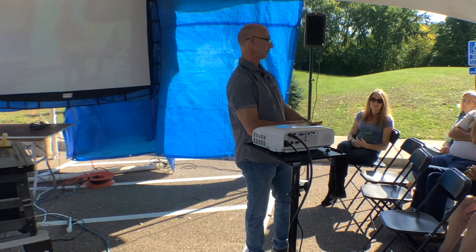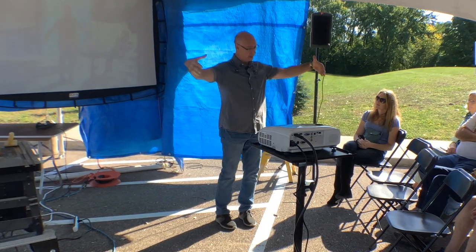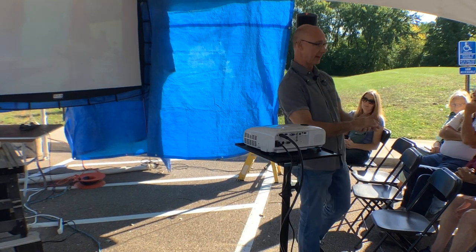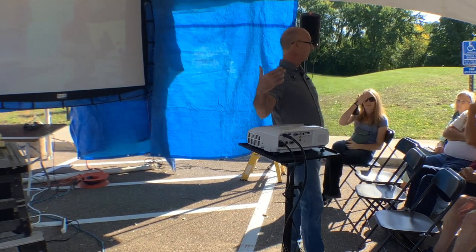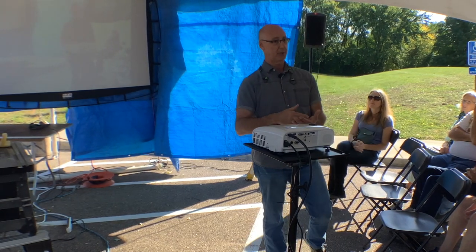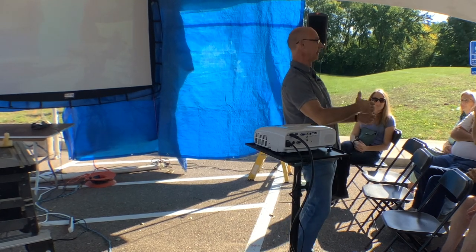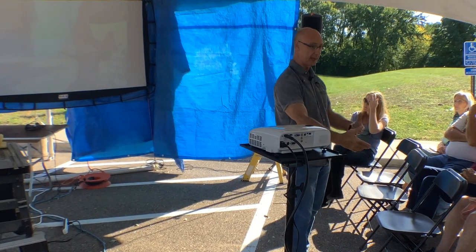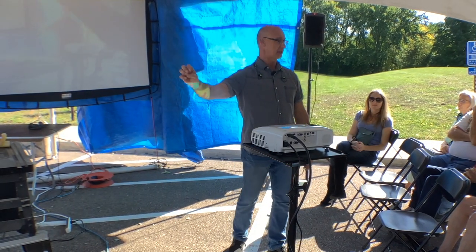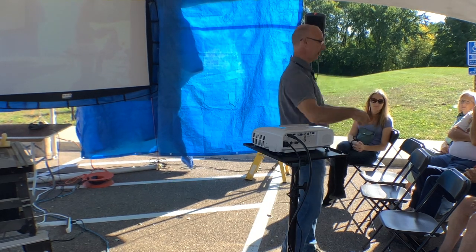Yes. Okay. Shapers versus router tables. Broad brush strokes. A shaper is a high power, low RPM tool. A router table is a low power, high RPM tool. So shapers typically have induction motors in them, the same kind of big motor that's driving big table saws, a stationary planer. Routers have a universal motor, that's what's in a shop vac, in a benchtop planer, in a benchtop table saw.